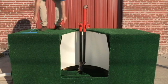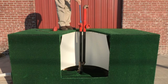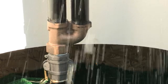The Main Guard 77 valve is uniquely designed to flush at one half to fully open while still covering the drain hole. To begin, open the hydrant slowly to avoid any type of water hammer. At the halfway point, you can see the drain hole is now fully covered.